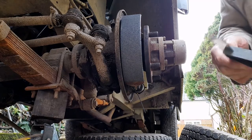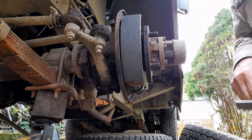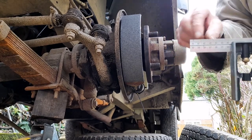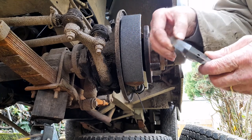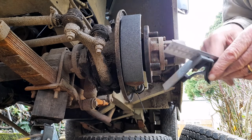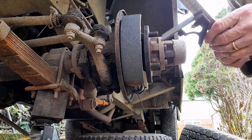When you come to adjust the angle of the shoe so it's parallel with the drum, the way I've done it is to make sure that this is totally parallel to this part of the square by using the kitchen worktop and a vernier caliper. Just so each end here, make sure they're parallel.